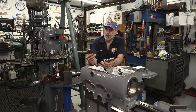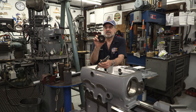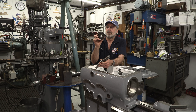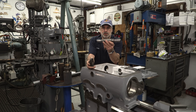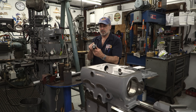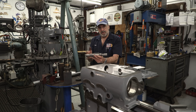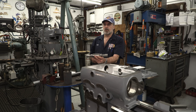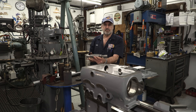The teeth and everything else are really good on here, and the keyways really aren't destroyed. It's just the bore itself, and the keys still look like they're going to be manageable. I'm going to make sure and double check on that. We're going to make a new shaft. So we've got splines, we've got keys, we've got heat treating, and we've got grinding. That means that tool post grinder that's been in a box forever — I need to get it out, get it set up, and get it operational. This is going to jump-start getting a lot of other stuff going as well.